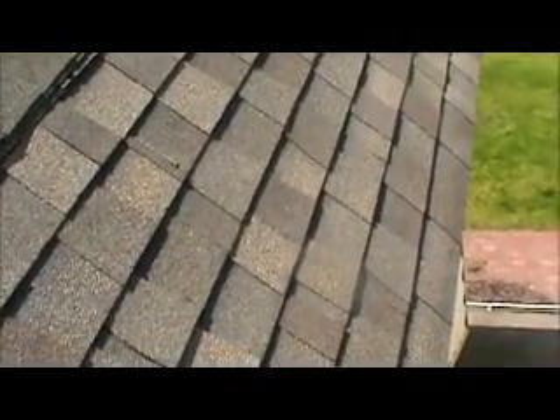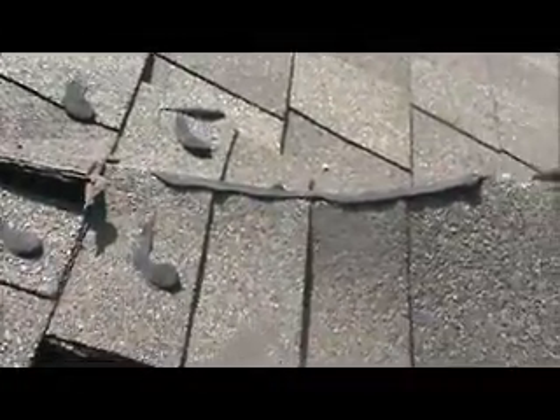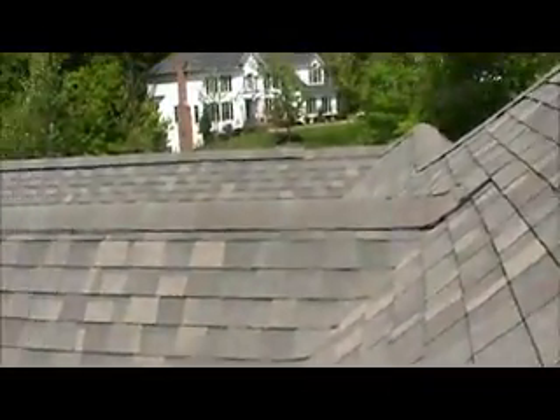This is facing the house — the three dormers on the left-hand side of the front. All three dormers need to be capped. Somebody was here about five years ago and said the caps need to be removed, and you need to put in ridge vent, shingle vent, and then hip and ridge caps for these kind of dormers. The dormers are too steep.